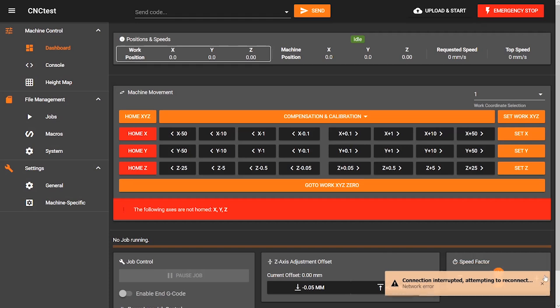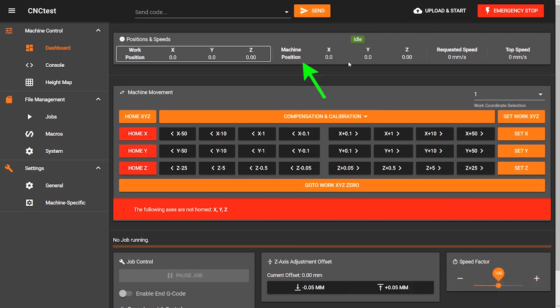The main change is that you can now see your G53 machine position. Alongside this you have your work positions, which you can change and toggle through a drop-down menu. When you turn the controller on, or each time it resets, you'll be prompted to home the machine, providing you enable the command in the config.g file in your systems folder.